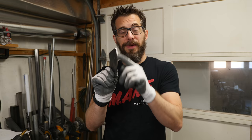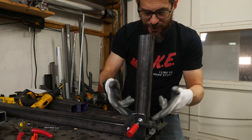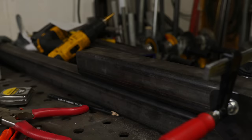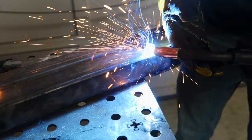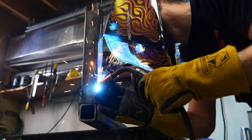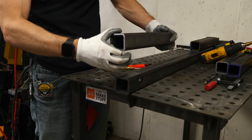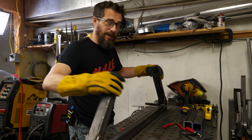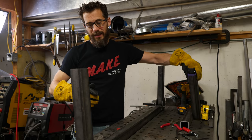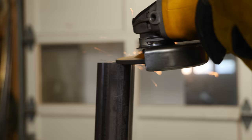I've got all these plates ground down to their final shape and I added a bevel so they're not sharp to the touch. I've got two of them clamped onto the leg with a bolt running through and there's no gap down here now, which is awesome. When you fold it up, the bottom of the leg sits on both sides, so this thing is good to go — we just need to tack it in place. Now that both leg assemblies are on and pivoting correctly, the next thing is to put the feet on. This is another piece of bar that goes right here, and this is why I cut the same angle on the top and the bottom of the leg — so this piece is actually parallel to the center bar and to the floor.